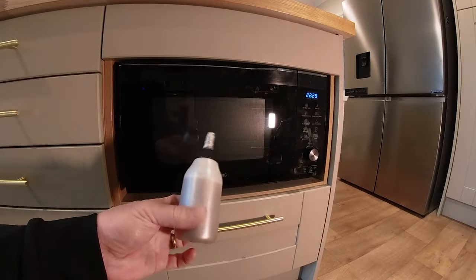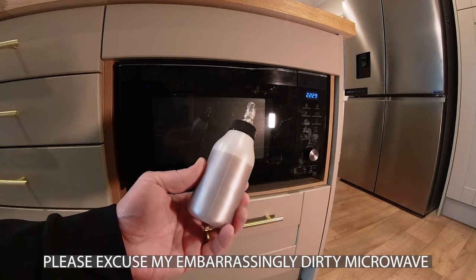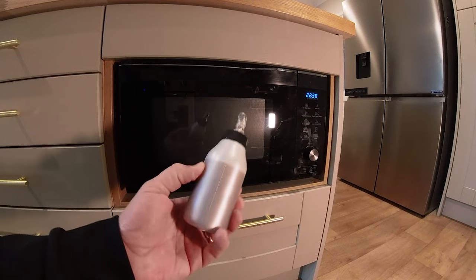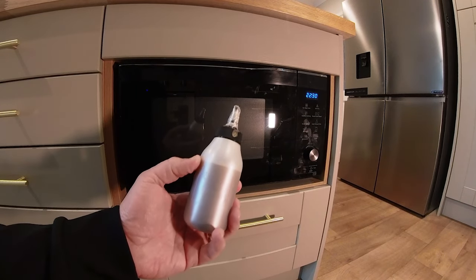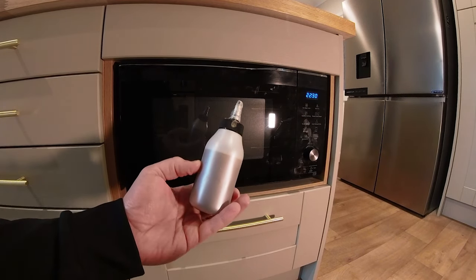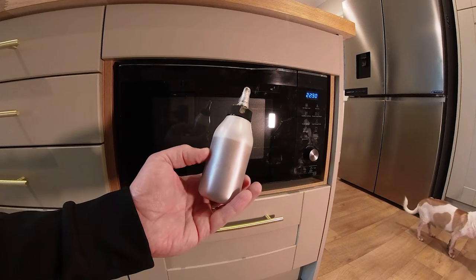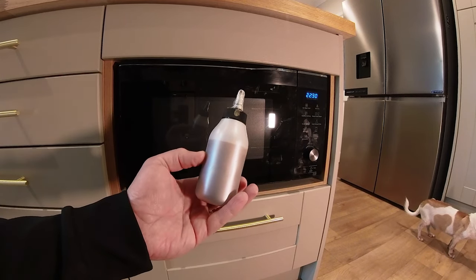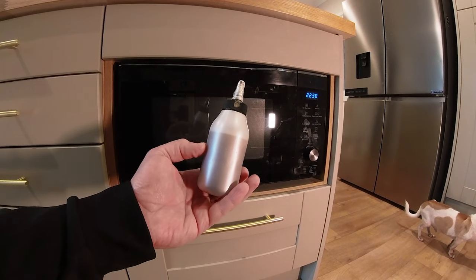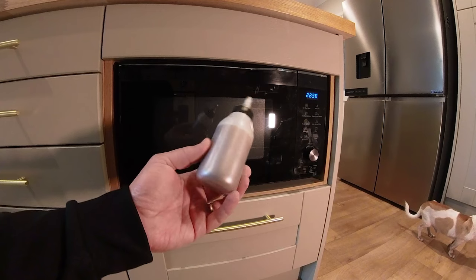Something I haven't covered before is reheating glue left over from a previous project. This is a month old — you can normally keep prepared glue for about two months before it will go moldy. The crystals will never go moldy, and you can even reuse the chip bits of glue that come off the glass. You just have to soak it to get the glass out and then you can reuse it.